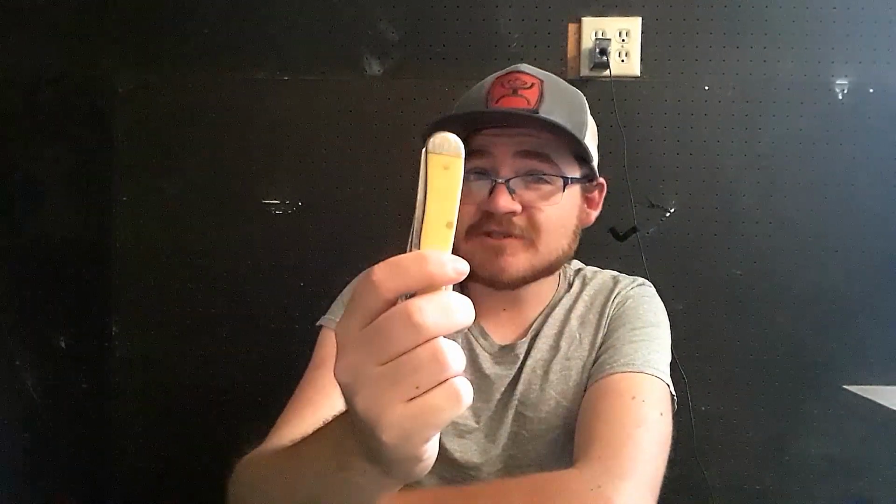So I decided that I want to start off with a 5.5 on the Mohs hardness scale, right? That's what I've learned knife steels to be. A 5.5 Mohs hardness is equivalent to an HRC of 59. That sounds just about right. Most knives, I think, especially nowadays, are on that 59 to 61 scale. Most steels too. Like I said, sometimes I was noticing that my case knife was scratching more in the 4.5 range. I would guess, let's actually see what 4.5 is.